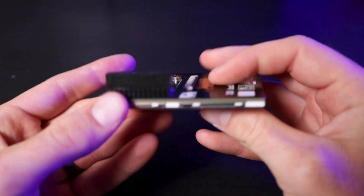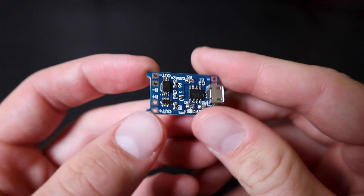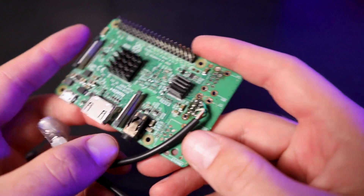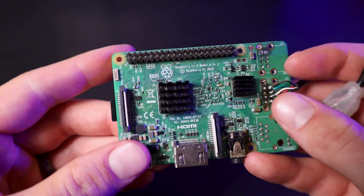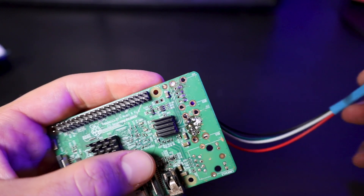Now, most of the electronics in this project are the same or similar to the full-size teleprompter that I made. I've got a 3.5-inch touchscreen for the display and a Raspberry Pi acting as the brains. I'll also have an Arduino Pro Micro reading button inputs and emulating a keyboard to allow the vlogger to speed up, pause, and slow down the script. Raspberry Pis are incredibly hard to get a hold of right now, but luckily I have a Raspberry Pi from a previous failed project. I ripped the USB ports off though, so I'll have to solder a USB cable directly to the pins to allow the Arduino to communicate with the Pi.